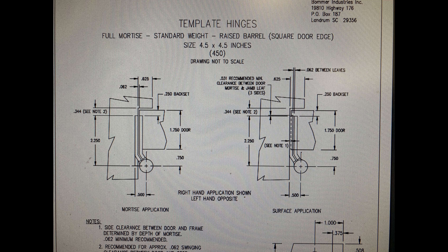It won't bind. What will be the margin between your gate and your post? At least an eighth of an inch. If you have a typical inch-and-a-half tube and an eighth-of-an-inch margin, you are not going to bind on anything. The reason you would move that vertical axis out — using what we call a wide throw hinge — is so that when you get the door to 180 degrees, you would clear any sort of applied condition: casing, molding, stone, limestone sill. That's why you would pull that vertical axis out. In that case you would need that radical bend on the raised barrel. Your vertical axis is just going to stand proud of the jam post.